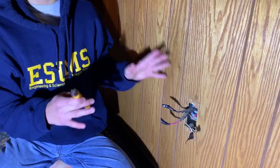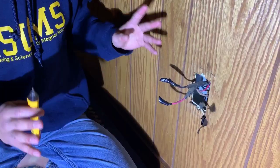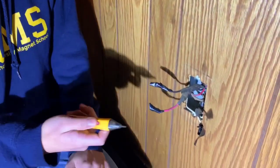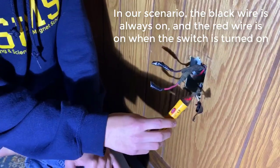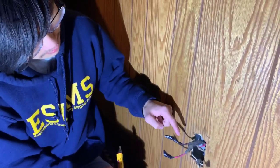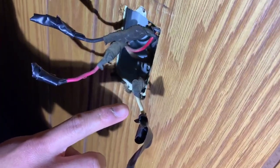Now let's take a look at the wall. First off, we want to make sure that it's not live right now. The first way you can do that is to switch off the breaker. But in order to be completely sure, you can use a special tool like this — it detects if there's any current floating around. You can see that when it's beeping, it's detecting current, and when it's on the neutral wire, it's not detecting current. These two wires are hot or live wires, and this white wire right here is a neutral wire. So when it detects these black or red wires, it should be detecting power; but if it's put up to the white wire, it shouldn't detect any current. Keep in mind that for some very old houses, the white wire doesn't mean neutral — it can actually mean power, so just keep that in mind.